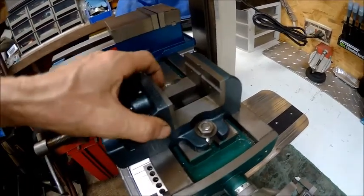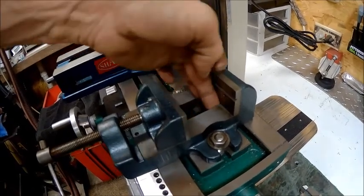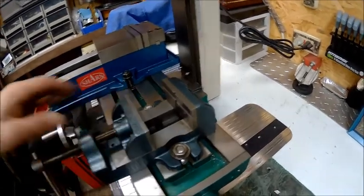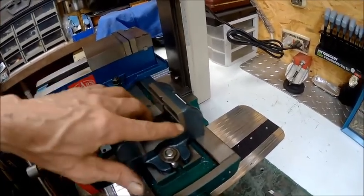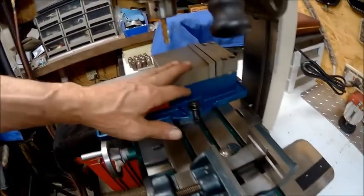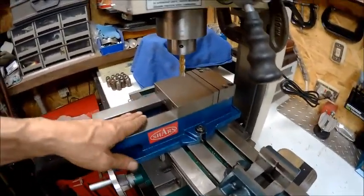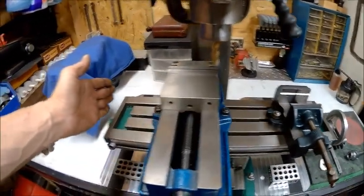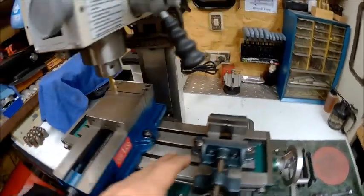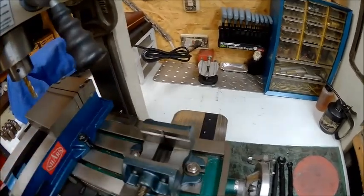And it's got adjustments on the bottom of it for adjusting it, so it actually is machined, both inside and out, and the bottom. The reason I put it on here is because I'm always needing that V groove when I'm doing round stuff. So now I have both options. I can go with the big one, and I made sure that the table travel was okay for this one to get me at least to here, to be able to utilize this whole area for each small piece.